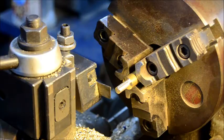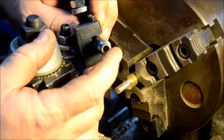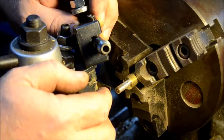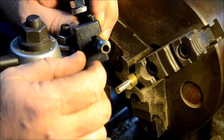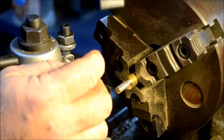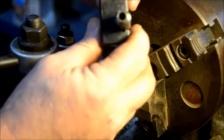Another interesting way to make a post spherical shape is to use this kind of cutter. I took a piece of drill rod tool steel and turned it to about 3/8 of an inch OD, and I drilled a hole in the center - a quarter inch - because the post heads on the 28m are quarter inch in diameter. I drilled a hole but didn't tap it, and then I heat treated it by heating it up red hot and quenching it. I haven't tempered it, so this is just hardened on the end. It's massive enough that I don't think I'll have a problem with it being too brittle. The interesting thing is there are no cutting teeth on this - the hole in the center ends up becoming the cutting edge for creating the post.